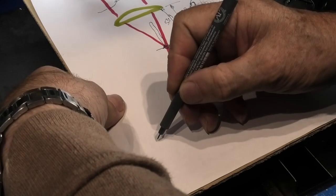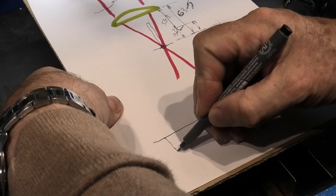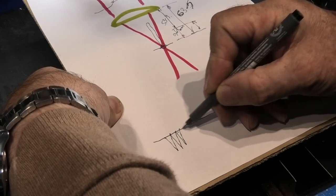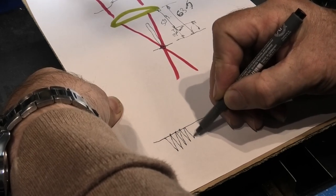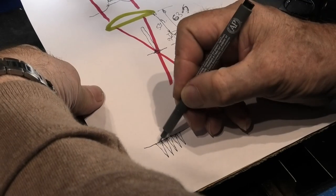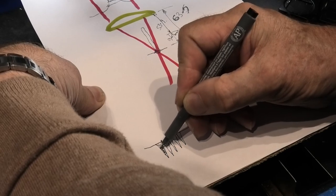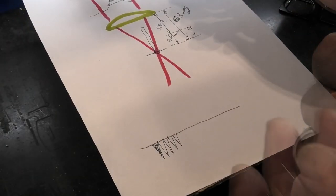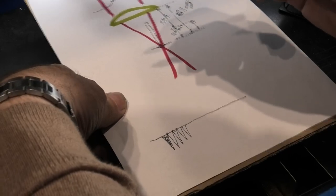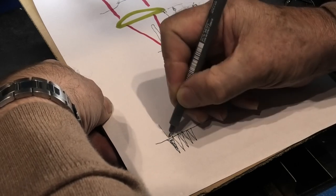Well, the first thing you've got to remember is we're not doing continuous engraving. What we're doing, we're producing a series of holes like this in the surface of the material. We're continuously switching the machine on and off and on and off. You can hear it. Now, what that means is that here we've got material which is solid and it has to be evaporated. It produces fumes. You've seen the fumes coming up. But the thing is, in this instance, the fumes have only got one way to go. They can only go up.